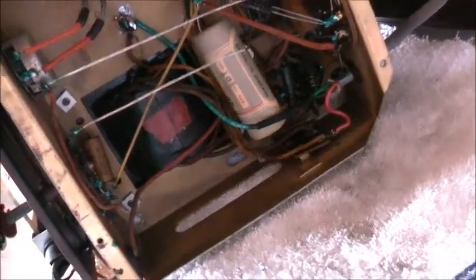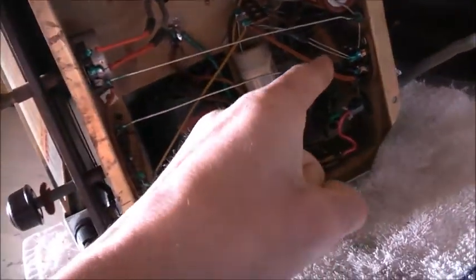I think it's a bit louder too, so definitely those capacitors would have been a bit leaky. Yeah, talk about a performance. I have to order some proper .05s and everything, because I'm not going to put them together in series in these little tight spaces. Or parallel, I mean.